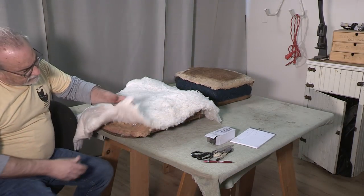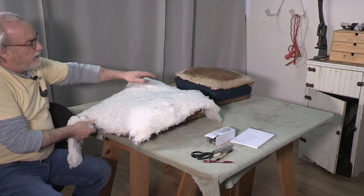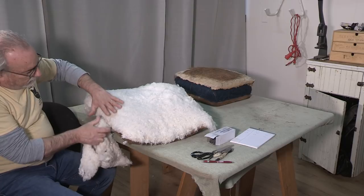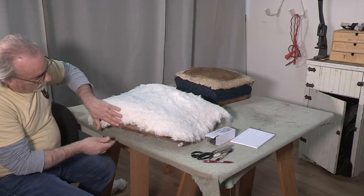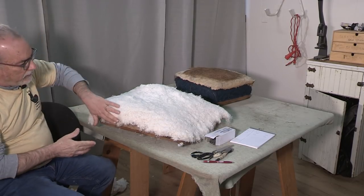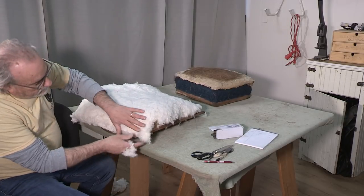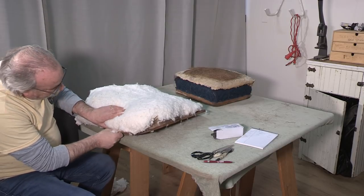And then we're going to trim almost where the cotton is now, but I'll show you there is an exception on the side. I'm just going to trim to this piece of wood here, but we don't want to overlap. We want to keep that a little clean there, okay? Our fabric is a very heavy fabric, and I'm making a determination now that I don't want cotton to bulk that heavy fabric up. The fabric itself will be fine. If it were a thinner fabric, I might even be using a piece of muslin on this.